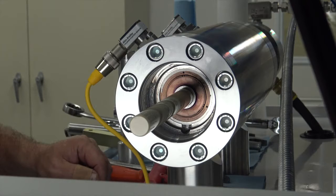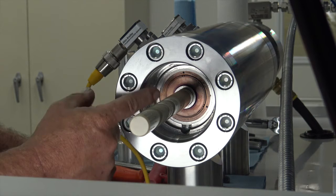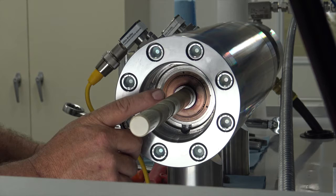We've got our high pressure cylinder off and out of the way, so we gain access to the area to change your hydraulic cartridge as well as remove your plunger if needed.